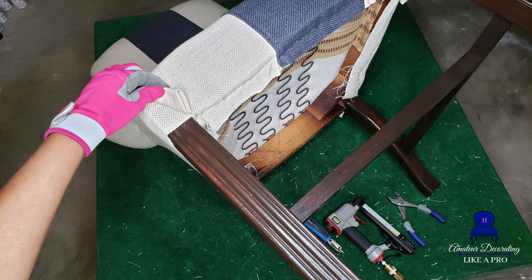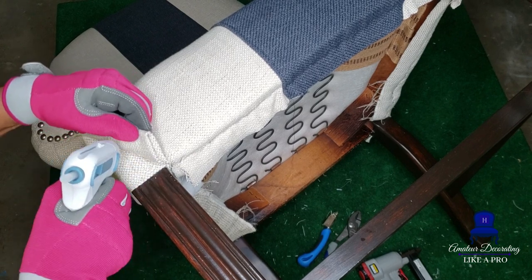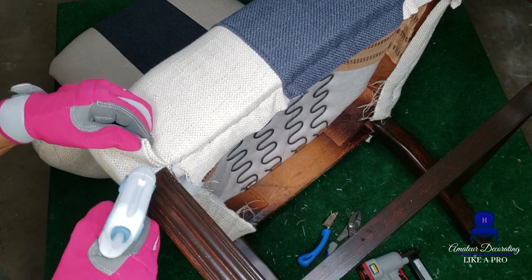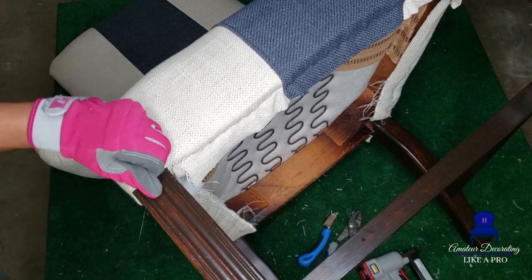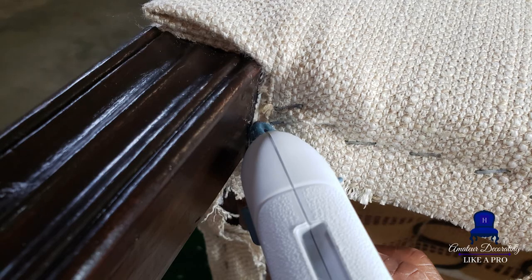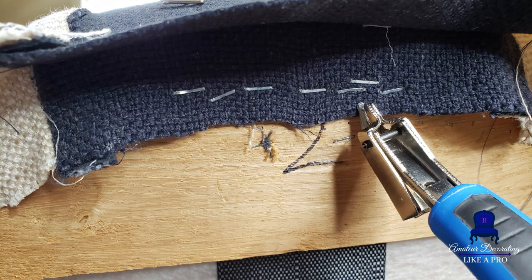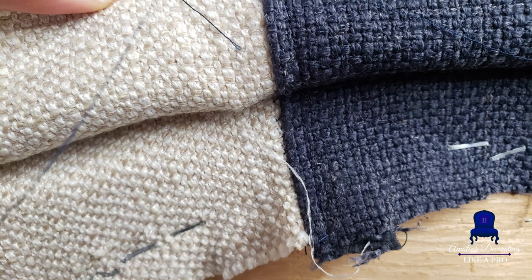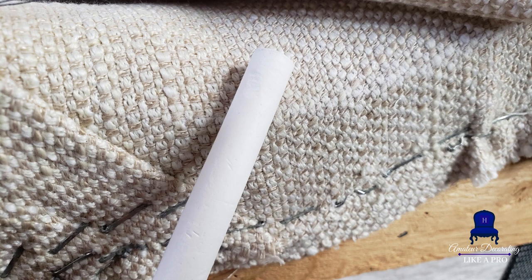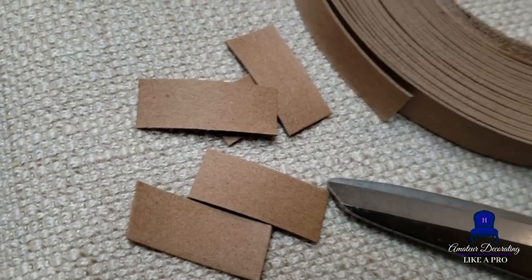I do use clear hot glue to assist with anything I might be concerned about fraying — that cut edge along the chair leg here. If you're concerned about something fraying, maybe the areas where I removed the staples and there are little runs in the fabric, I'll add a drop of clear glue underneath the chair in that spot. I am applying staples at a pressure of 60 — 40 is not good, at least not for me with these heavier staples. We're on the back of the chair now. I've got my chalk here, just marking where the actual wood is so I can staple in that cardboard strip.